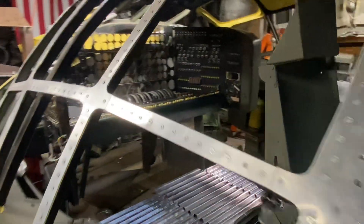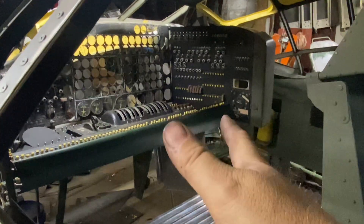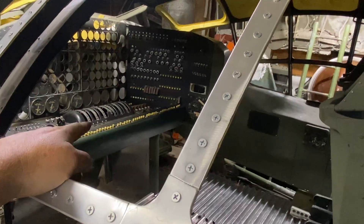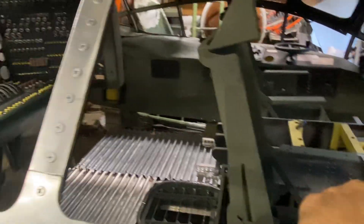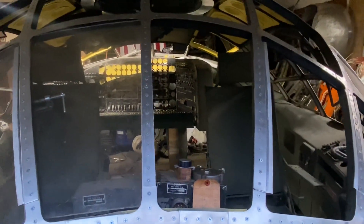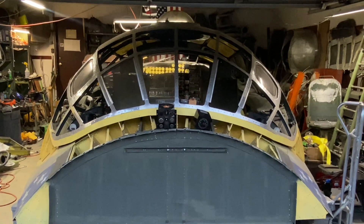The good news is what you see here is essentially what you will see on the flight engineer station. You've got your six throttles and to the right, six mixture controls — the mixture controls are identical to the jet throttles, so if I can build the jet throttles I can build the mixture controls. The piston throttles are big pulleys linked via cables down to these throttles, which aren't nearly as complicated as what you just saw. The engineering is out of the way — it's just a matter of copying and pasting it. Hopefully it won't be too hot a summer and I won't die — if I do, I do. I'll see y'all next time.